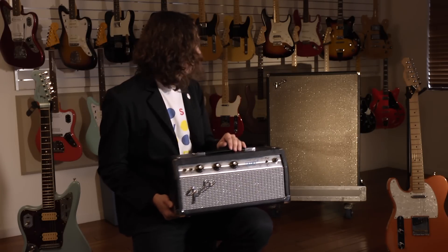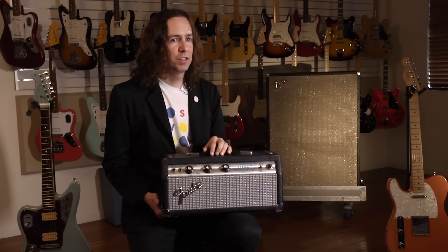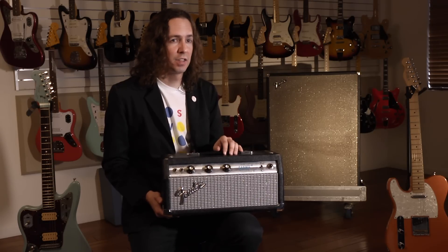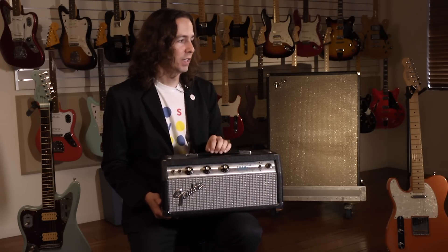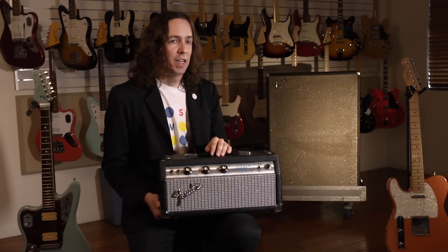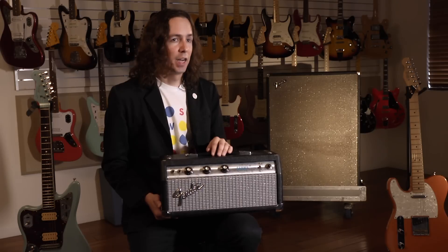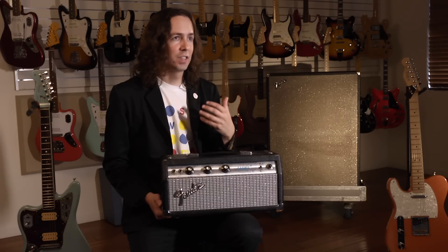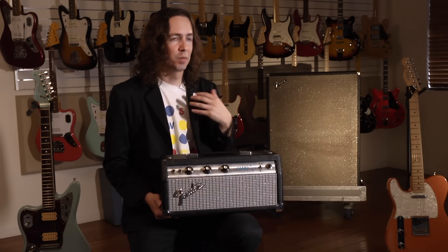That is like a late 60s Fender 212 upright cab. They only made those for a few years — late 60s, early 70s — to go with either the Bassman, Showman, Dual Showman, or Bandmaster heads. As soon as I bought one and played through it, it was such a unique sound that I had to have more, so I bought up a couple more. I've done a little work to those as well — I switched out the speakers for Celestions and Vintage 30s, and rewired it. There are two 8-ohm speakers in parallel, which gives a 4-ohm load.